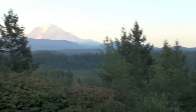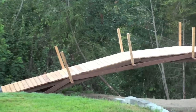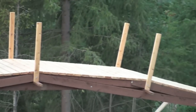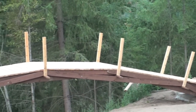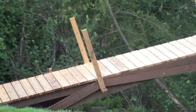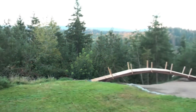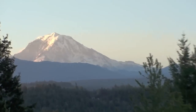We're going to finish putting the railings on today. You can see we've got the side posts tied into the existing carriage bolts in the structure itself. Just lined it up, tapped it with the hammer to make a mark for drilling, drilled a hole, put a carriage bolt in it. We should be finished up today — it's going to be a hot day. See the mountain.